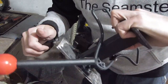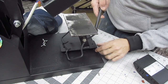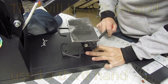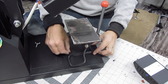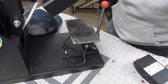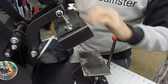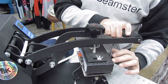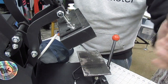I've got some welds on there — they're not the best welds, but they're going to hold. Back inside, here is the bottom plate. This goes back on like that — this is the arm that holds the hat spring down, but I don't know if I'll use that ever again. These little wing nuts will simply go right back inside here, secured nice and tight. The top plate here adjusts up and down, so when it comes down flat onto that bottom plate I'll be able to adjust it for just the right press.